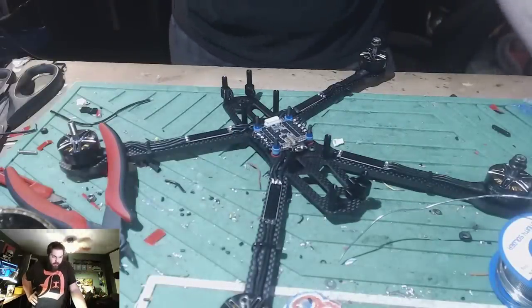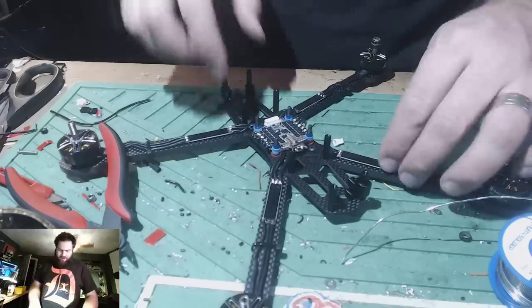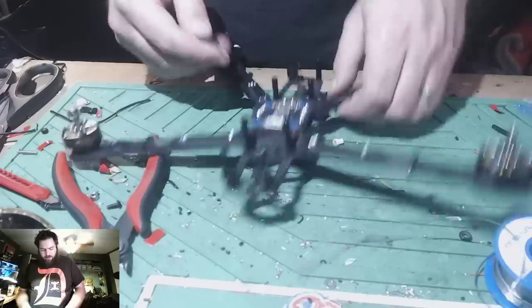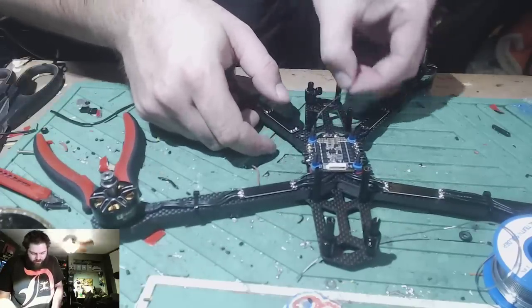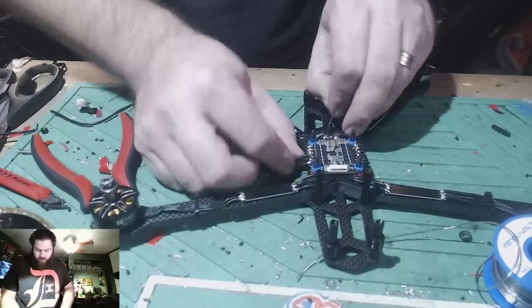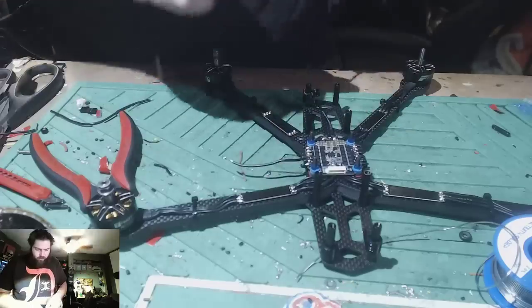Okay. Dude, there's nothing better than a good patch antenna. Yes. In theory, wouldn't a short antenna have better reception because of less coax loss? Not if a shorter antenna is like hiding the antenna below the carbon on your frame or something like that. It's a balancing act, right? The more coax, the worse the performance is going to be. You're absolutely right. But if the antenna is so short that it is just hiding behind carbon the whole time you're in the air, then it's not very useful to you anyway. So you have to do that math of what's going to work best for your situation.